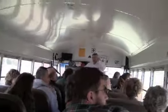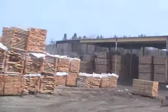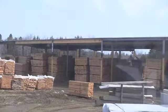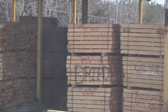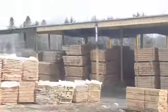You'll see an inch airspace put every layer of logs, and just like the 2x6 here also. We want to dry the cedar very slowly. The slower you dry it, the less checking and cracking there is.